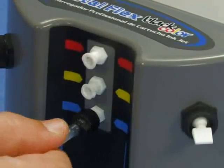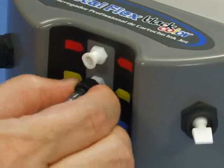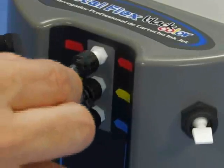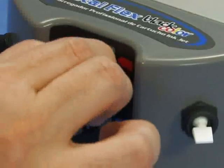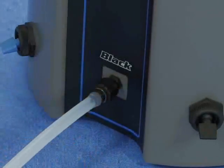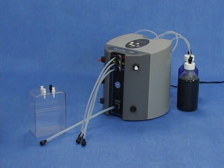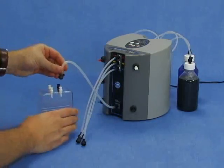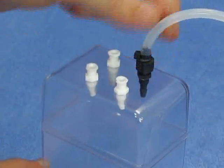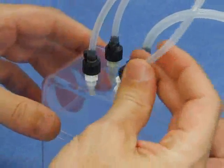Now, at the front panel of the machine, connect the three hoses at the three color ink output connectors. Connect the black ink connector using the thick hose right below. The machine is supplied with an acrylic box with four connectors on its lid. The collecting box is used to arrange the hoses during the machine's operation, and also gathers possible ink dropouts during the process. Connect the machine's front hoses to the collecting box connectors.